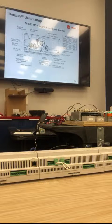We've had people on the extreme end who have no hot gas reheat or little hot gas reheat, or they have fixed speed compressors. They've got 2 fixed speed standard scroll compressors, and they want to maintain plus or minus a couple of degrees. Sometimes even with the gas heat, if you're at the point where you need that second stage of gas heat, the first stage at minimum is still too much. There's a minimum temperature rise you get off the gas heat, so there are going to be some outside air conditions where it swings a little more. If you need 75% of the heat, we can probably maintain a pretty precise temperature down the ductwork, but that's not always the case.